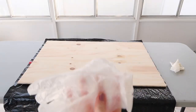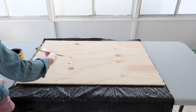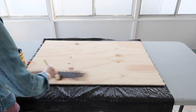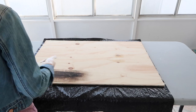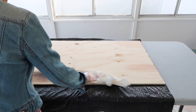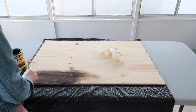Now we'll take some gloves, a paintbrush, and my favorite Minwax dark walnut stain. Usually when I stain I use a paper towel or cloth like an old t-shirt, but this time I wanted to use a brush. I'm dipping the paintbrush into the stain and then wiping it off with a paper towel so it's not super thick, and then I repeat this process. I'll speed this part up.